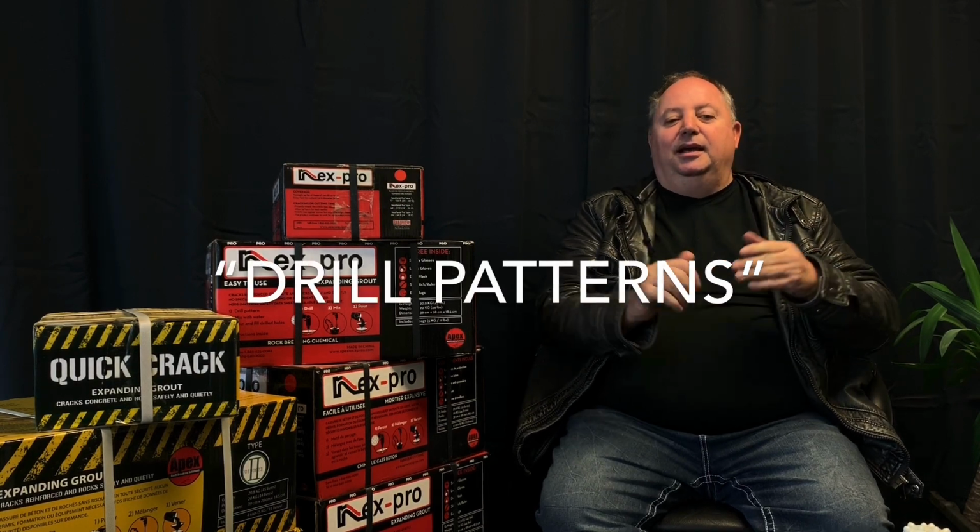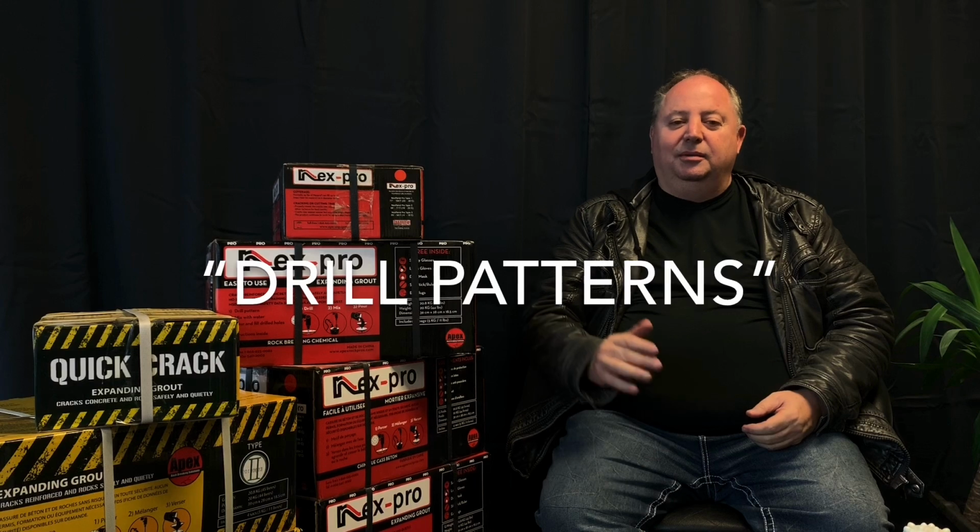Morning, people. Today we're going to talk about a drill pattern and how to break rock or how to break concrete effectively. Sometimes where people go wrong is we say drill a 1.5 inch hole, they drill a 3/4 inch hole, and then they get surprised why it doesn't work. So the simple physics behind grout is it creates pressure.